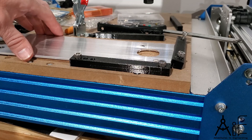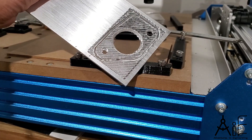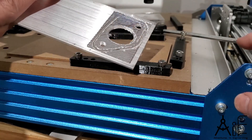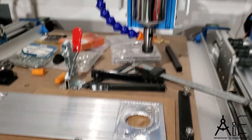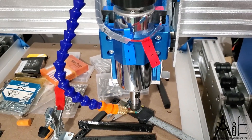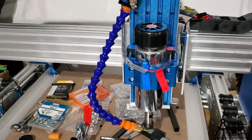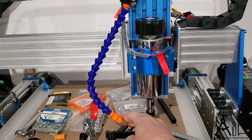Since I'm planning on cutting aluminum as a regular thing with this CNC, I found that my parts got too hot. They started melting edges and caught up the CNC bit, so my parts ended up not looking good. I determined that it's getting too hot, so I've decided to add an airflow system pointing at the bit. My next project is to add that in, and I'm going to connect up the hose here and run it through the wiring loom out to my air compressor.